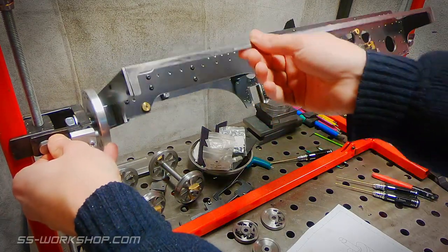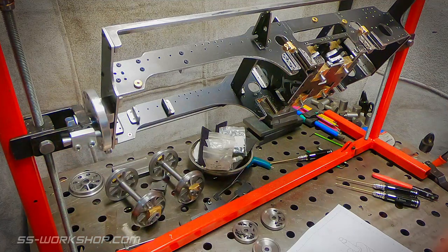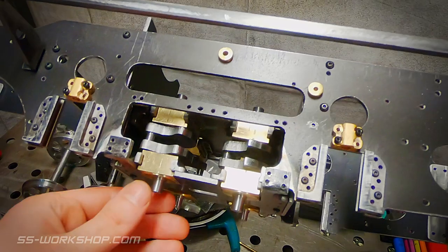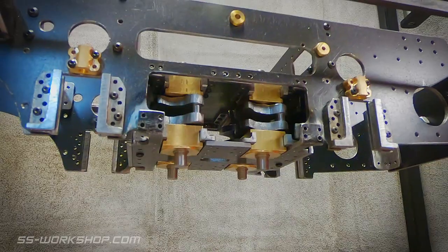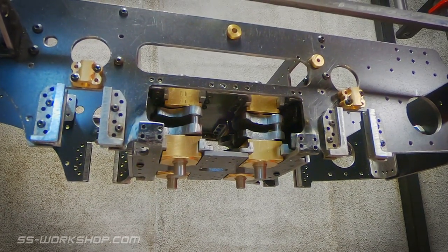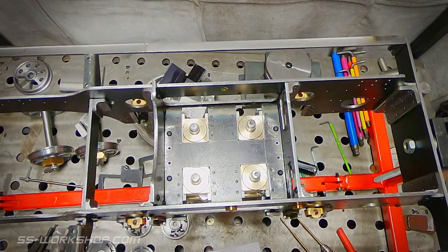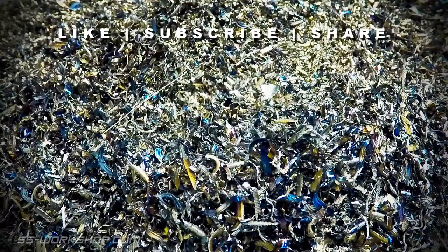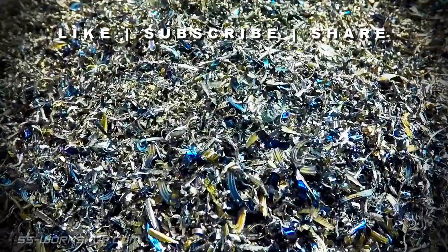I could then locate the crankshafts into their axle boxes. As you'll notice, this area is already getting busy and we still need connecting rods. These crankshafts were a real challenge to make, but I think they were worth it in the end. Turning one piece crankshafts certainly has an advantage ensuring the entire assembly is concentric, but as I found there's little room for error. And if you're new to the channel, don't forget to subscribe. I look forward to seeing you for the next episode - catch you next time.